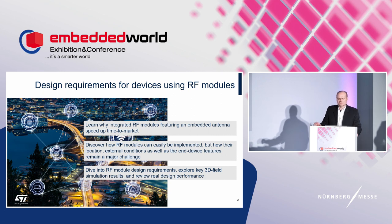But it could also have some usage constraints. Let's say the RF performance is limited if wrongly applied. The reason for impacting RF performance is mainly the antenna. The antenna must fit into a small space in the module, so it can suffer from its small size. Now we will deal with RF parameters and performance of the embedded antenna, while the application of the module differs from the recommended conditions. All results will be demonstrated on a 3D simulation model of the module fitted on a reference board.